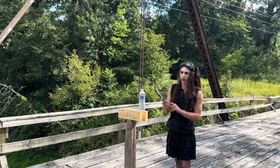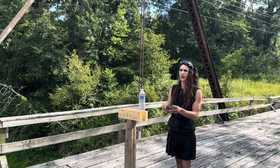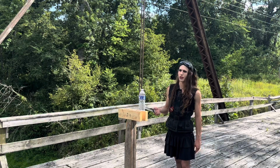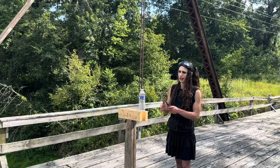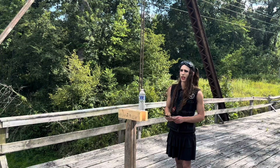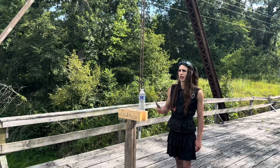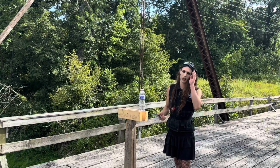It has a convex grind, which I don't do a lot of, which is kind of odd because it's really well suited to handmade. You can't really get it with machine grinding. I mean, I did use a belt sander, but that's not important. Instead of coming straight in, it's a little more rounded, which has to be done by hand, but it lasts longer and is more durable for survival applications. It's a lot harder to sharpen, but it's more consistent in a lot of ways.